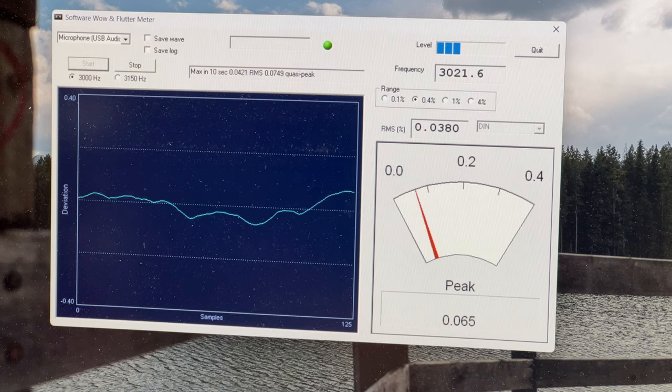It's going extremely well. I tested it yesterday after I got done most of the audio board capacitors, and it's still auto-calibrating just fine, at least on normal tape. I don't know about metal tape yet, but we'll figure that out in due time. Some of these capacitors are not accessible, for reasons I'll show you in a minute or five.